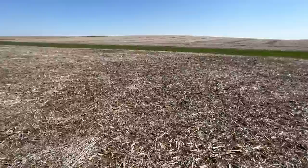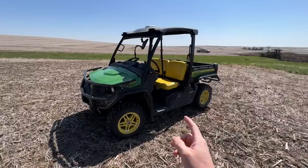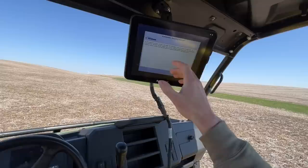I'm in the John Deere XUV 835M from Van Wall. Since we accidentally wiped all our field boundaries using a WAAS receiver, I got our RTK receiver up on top now and have to redo all of our boundaries. Last time I did this it took me 26 hours, so hopefully now that I've got the hang of it I can do it in about 20. When I found out we had to redo everything I gave Gary at Van Wall a jingle and he said they had a Gator available. We got the Ag Leader InCommand 1200 mounted inside and the GPS 7500 receiver on top. I really hope I do it right this time.